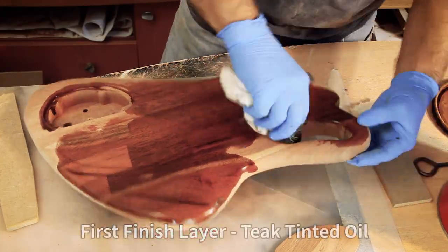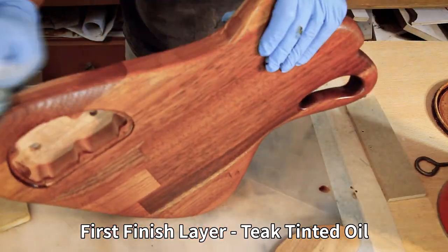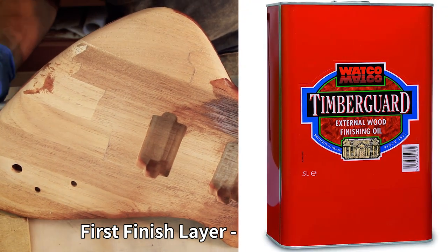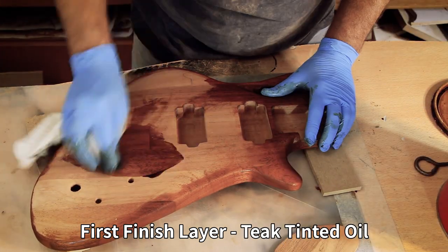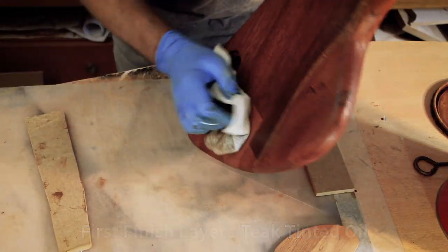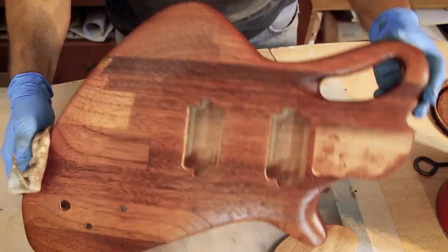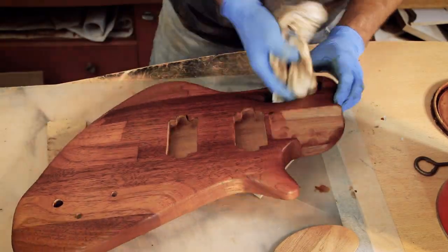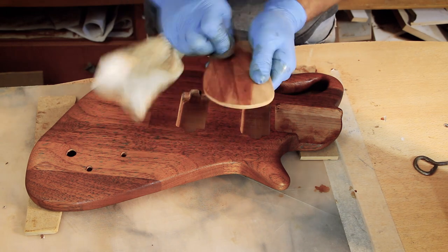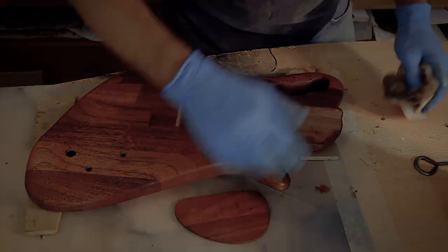I was planning on finishing with natural color and true oil, which always brings out the best of the wood. I did decide however to make a little test with a bit of teak-colored oil stain I had left over from a deck I built. It's a Belgian make called Timber Guard and it has very good penetration. Since it's oil, I figure I can build as many layers as I want with true oil afterwards. The color really works for this type of wood and brings out the grain and the beauty of it.